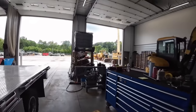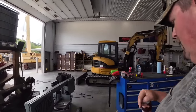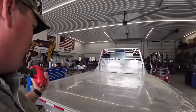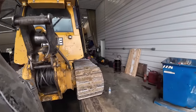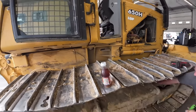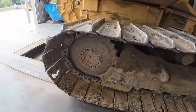Made it back to the shop. Got all our tools back. If you don't know, we are giving this toolbox away loaded full of tools in a few months — go to the link in the description to see how you can win those tools. Now Kevin's ready to change the rear roller out. We're going to loosen the track up first, get some slack in it. The bad thing with this rear one is we've got to unbolt this little rock guard — it's not real fun to get to the roller. Hopefully we don't break any bolts.